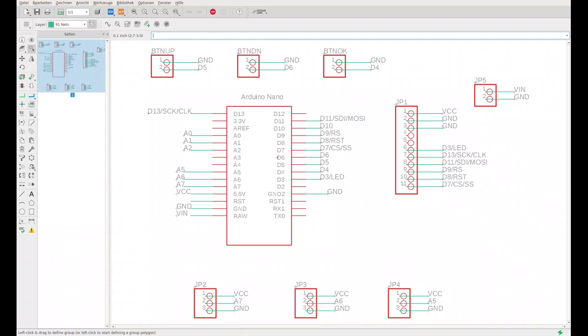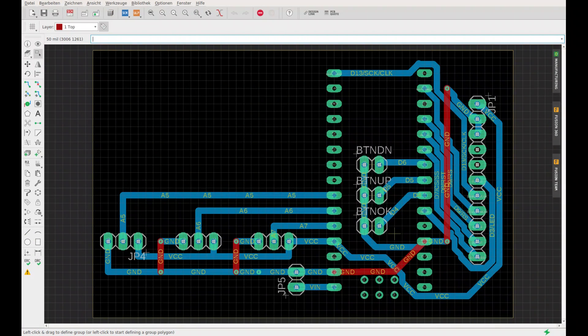Here's how to wire the whole thing. I have also included an Eagle project on my GitHub. Eagle is a great software to do schematic and electronic layout. Here you can see all the connections — we don't need much, just the buttons and a connector for the display. I have also routed a printed circuit board. It's a two-sided layout but I'm only using one side, and I bridged the three or four connections that are needed.